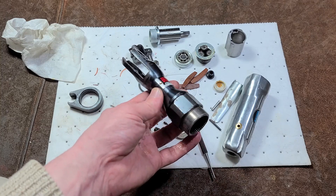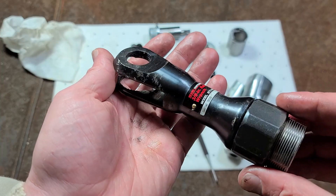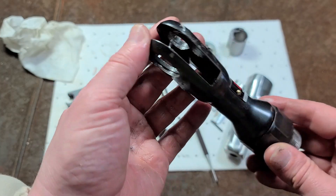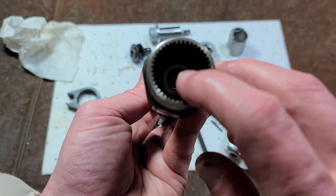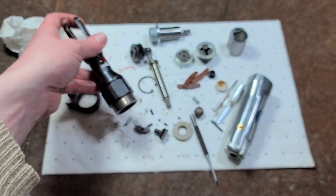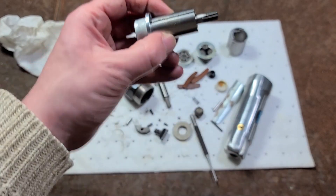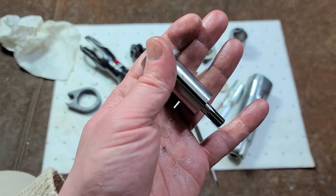Not that corded tools don't have machined parts, but this ratchet head required quite a bit of machining operations to get it all shaped out. The rod actually runs on a sleeve bearing rather than a needle bearing, unfortunately. But quite a bit of work goes into one of these, especially the vane motors, which really have to be ground and precisely sized.